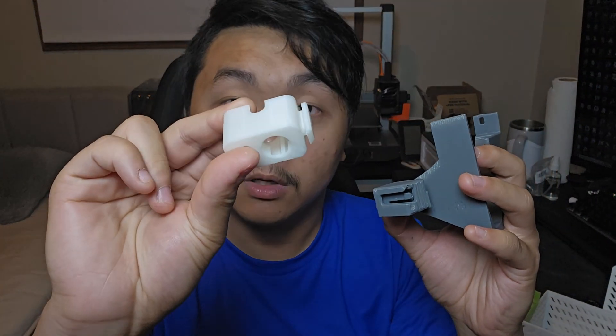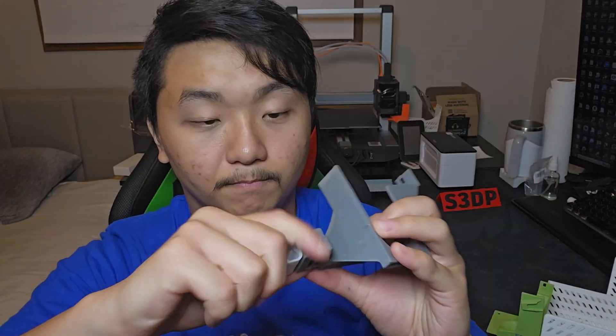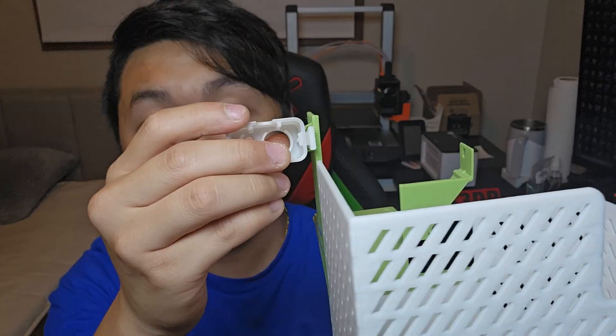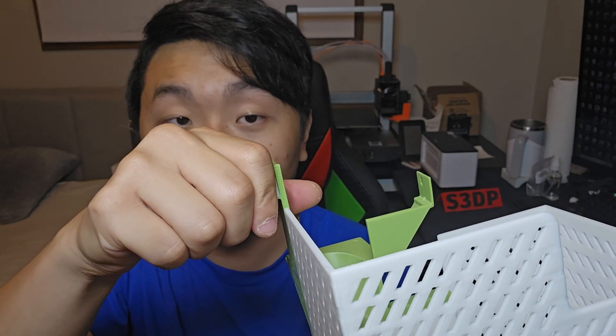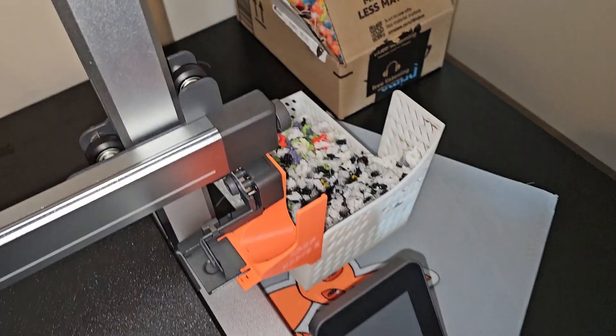So the first model here is the place where you can mount the camera, which you can 3D print. Everything will be in the description down below. You just slide it in right here and then it will snap fit, so you have a right-side camera mount — which is very nice. I took that idea and integrated it into my own design right here. I added this spot so that you can just mount the camera, you just slide it in. It has a very nice fit tolerance, and it does not go anywhere from there.